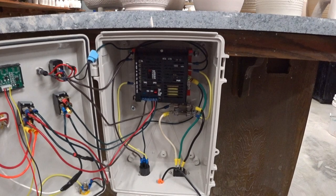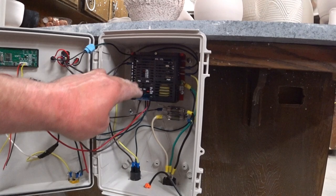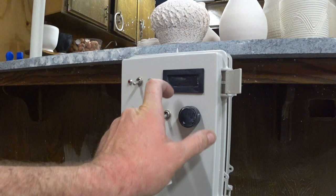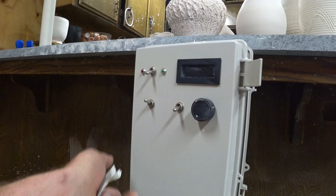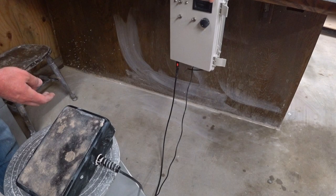I'm really happy with this speed control. These speed controls have the opportunity for a potentiometer, but it doesn't know I wanted two potentiometers. I wanted this one so I can set a speed and just leave it, but I can also flip this switch down and it disconnects this potentiometer — and then I have a plug for a foot pedal. With the switch up, it functions on the knob; flip it down and you're on the foot pedal.